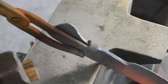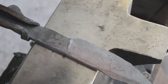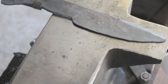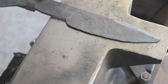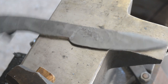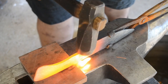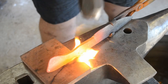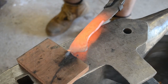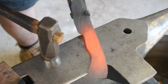I'm going to give you a visual representation of how I look for straightness. If you haven't got yourself a set of bladesmithing tongs and you're making knives of any kind, it is incredibly useful — if you can't make them, maybe investigate how, or find someone to make them for you, or buy them. To add a little extra swoop to the handle, I actually use this wood block at a middle face to introduce a little bit of curve, keeping that heat isolated to the handle, and that's going to give me a finer curve of the blade.